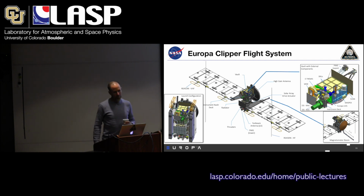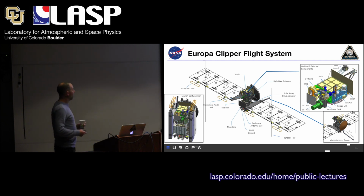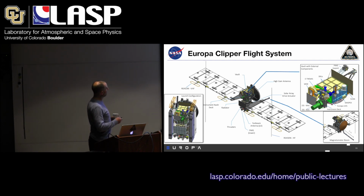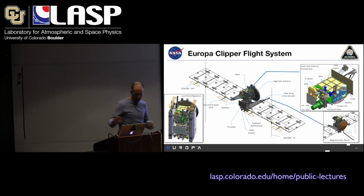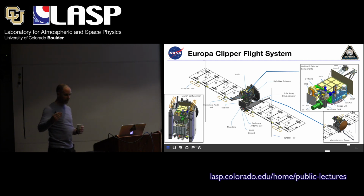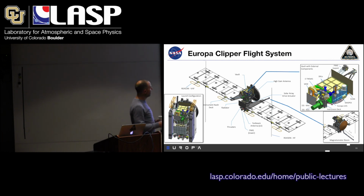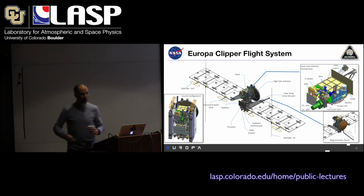It has some pluses and some minuses from an engineering point of view, but certainly you need a very big array. There's an instrument deck, a nadir deck that points, so when the spacecraft flies by, it does a pitch over maneuver, and so the spacecraft design is simplified by the spacecraft making a maneuver every time, so we don't need a gimbaled platform. One of these instruments is gimbaled, so it can do cross-track imaging.